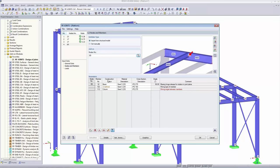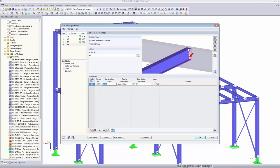So what we can do is use a trick. So the M102 is the beam we want to connect. So that's the beam. And we make the rest of it inactive. We just delete them. So that at the end, it looks like this. It's just a beam connected to nothing, basically. And we will use an anchor plate instead of the beam web. So we kind of simulate our beam web. And this is the trick. I want to show you how you can still design beam-to-beam connections, although it's not really ready to be used yet.